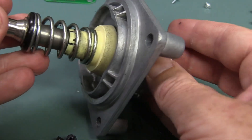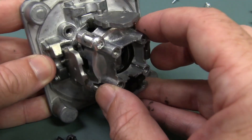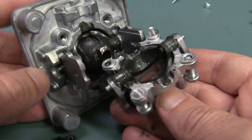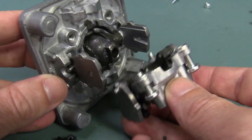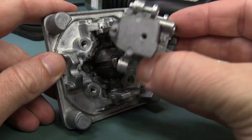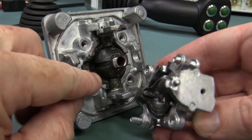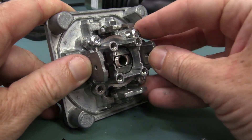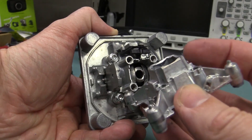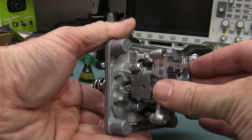And there's the money shot for you mechanical grease monkeys — look at that. Fantastic. I mean that is just a great work of mechanical engineering for such a simple function as a joystick, but to perfect it and get it right requires a lot of design effort and precision machining to really separate the real top quality ones from just junk ones. And you would think a part like that would be symmetrical, but it's not — there's a little pin in there designed to mate up with the hole, so it goes in one orientation only. And likewise for that part too — it's got a little key which mates up so you can't mount it at any other orientation.